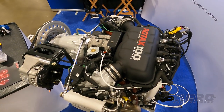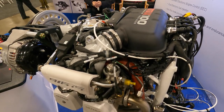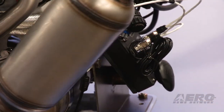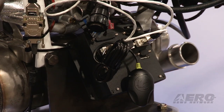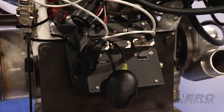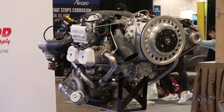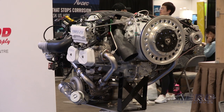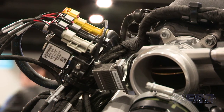Like we can see here, we have a single lever power control, making the engine a full FADEC system, controlling the propeller speed all the time at the optimal point and setting the best pitch on the propeller. For example, the Kitfox or the Cubcrafter aircraft fly with the single lever power control, reducing the workload for the pilot and bringing the engine to the most efficient point.